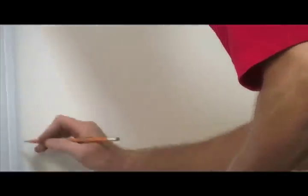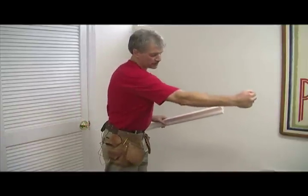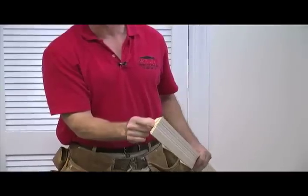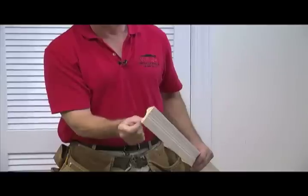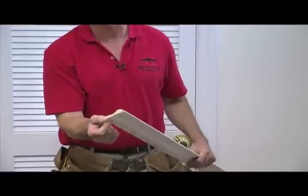So I'm getting one right here, and we know we're going to have one here in the corner as well. I've back-cut this piece of molding that we're going to run our next piece into. I prefer to cut them at a 22.5-degree angle. I know some people like to cut them at 45, but I feel like I get a little bit tighter seam when I do a 22.5-degree angle.